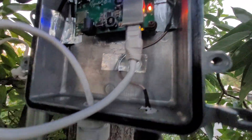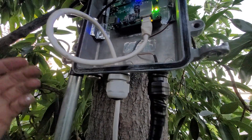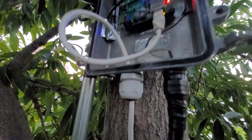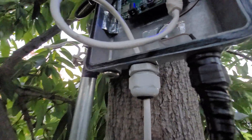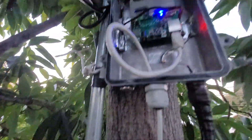Same thing for the antenna — I did the same thing. You can see I've got Teflon tape on there, which just prevents water from getting in. On the bottom screws you shouldn't have to worry too much because water's not going to go up against gravity. But do wrap your antenna connectors to prevent water from seeping into the connection and corroding over time.